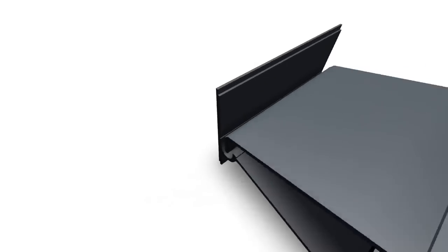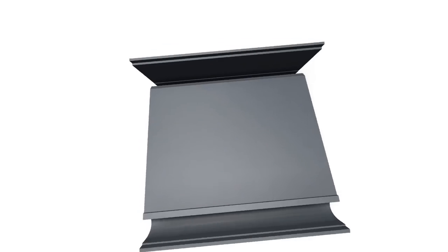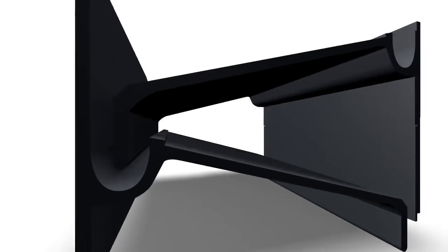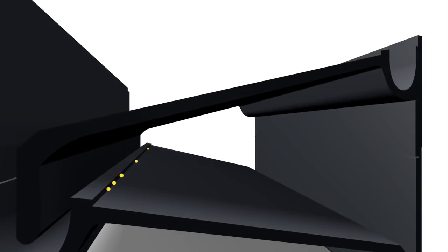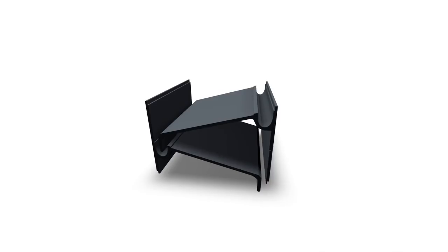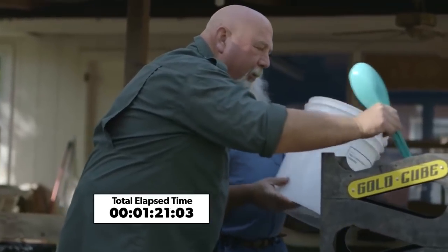You feed it into the slick plate, it starts spreading everything out. As soon as all that stuff spreads out, it goes down into the G4 separator. It throws the gold to the outside edge, drops it into the mat. The mat holds onto it. At the end of the day, you can run it for 5 minutes, you can run it for 15 hours. It doesn't matter. It's not going to discharge any of your gold. See how that busted right loose? Yeah.